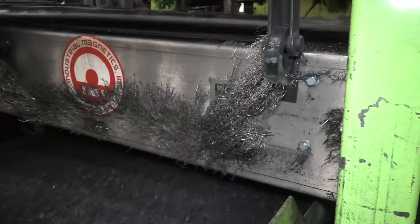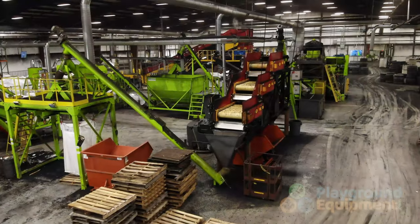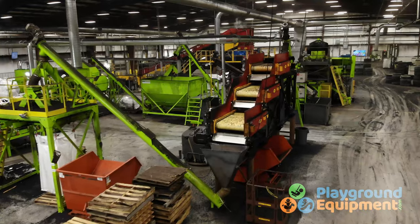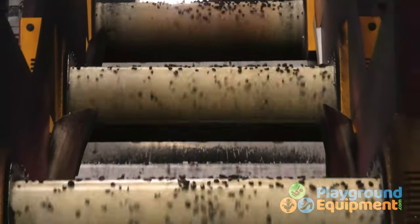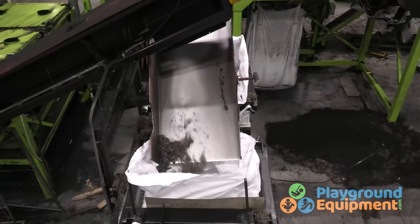You can see the steel shards literally pulled up and away. For some recycled rubber mulch, that's the end of it — but with Play Tread, our new process uses three additional magnets to extract all the metal from those tougher truck tires. Any metal that's missed after passing through the first three magnets is then fed through a waterfall magnet that has three additional capture points to remove the rest of the metal present.